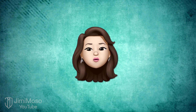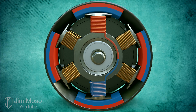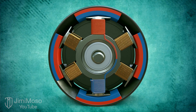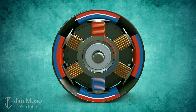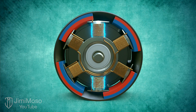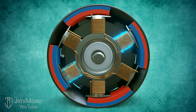But how do we improve the rotational spin or torque? One way is to extend the coil from the stator pole and wind it around the opposite stator pole. This, in essence, turns this set of poles into one electromagnet — now here is north and this is south. When you run electricity through the shared coil, you're activating both magnetic poles at the same time. These two poles now draw these two permanent magnets and you've just doubled the attraction force. Now just repeat this pattern — we coil this set of stator poles together, and here's the third set. As electricity flows from one set to the next, each set of electromagnets takes a turn drawing and pulling the permanent magnets.